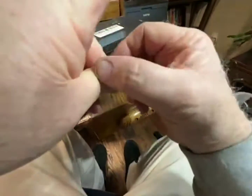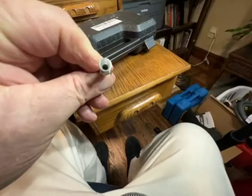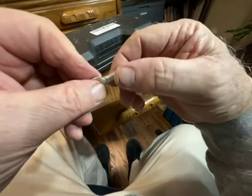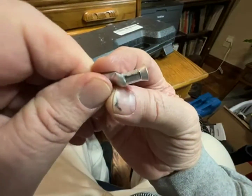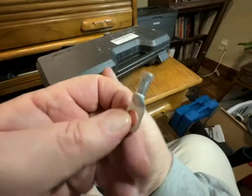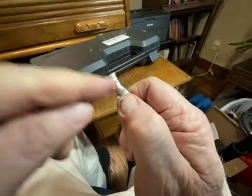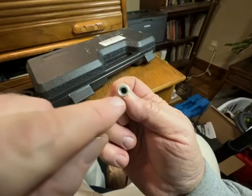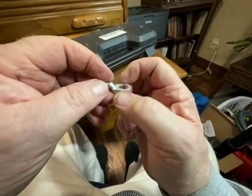And I intentionally didn't do this with wire so that we can see how the crimp works. What it looks like in there. See how it's crimped it on all sides? I hope you can see that. Very symmetrical. When you use an anvil, which I've used forever, I mean, when I started off making these, I used a dull chisel, put them on the vise and just hammered down. But this constricts all the way around, and it's pushing in from every direction.